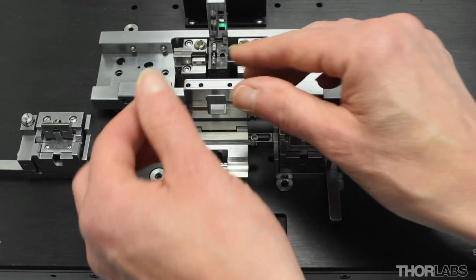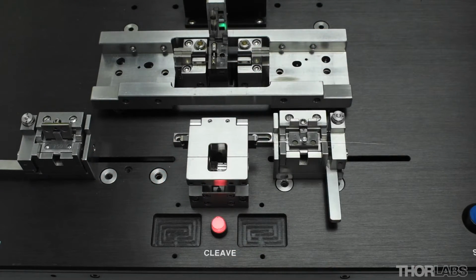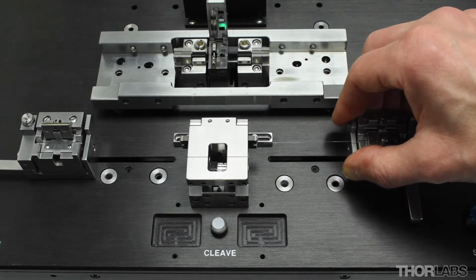When the fibre holding block is at the stripping position on the workstation, the coating is captured by the strip inserts. Heat is applied which softens the coating. As the fibre holding block is slid backwards in the stripping slot, the softened coating is removed by the blades.